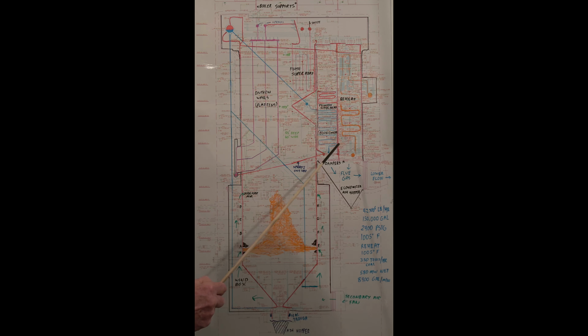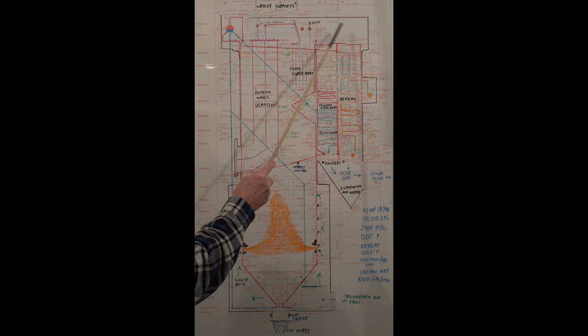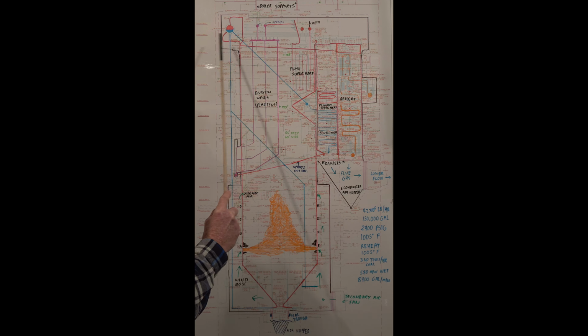The big thing, this whole boiler is supported from the top. It's all hung off of hangers. I can see the large beams. We mentioned that in one of the earlier videos. I can see down here, it grows about 11.5 inches. There's a water seal. Make sure this thing's full of water and it overflows into your ash hopper. This is all bottom ash hopper water.